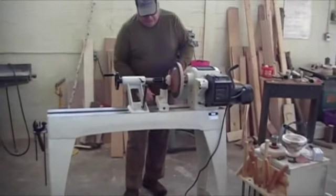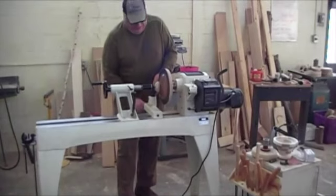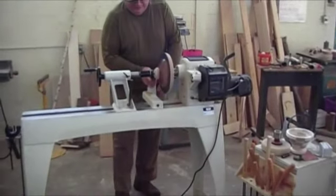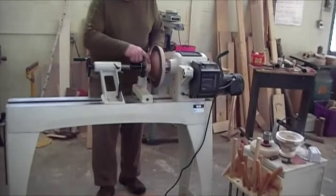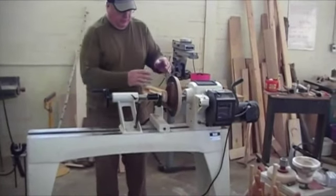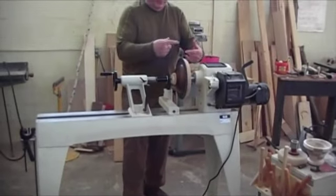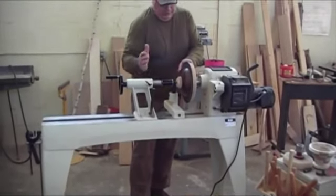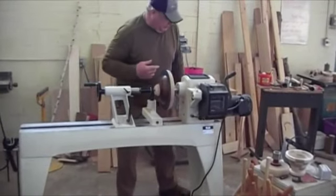Some of us who are more advanced — I know you should have one if you do a lot of turning. You should have a vacuum chuck. I know I have one. You're going to leave some of the maple on the wood? I'm going to leave some on there, yeah. I'm going to see what it looks like when I get down there. I did take the time to mount this on that screw chuck, and I scraped it off so it was parallel, and then glued that on. So it should be pretty close.